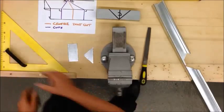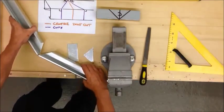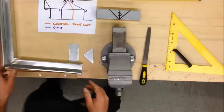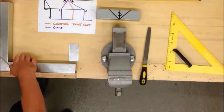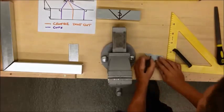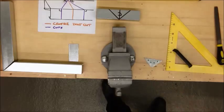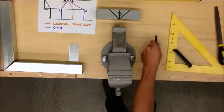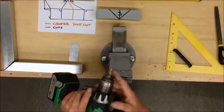Next up, I've got a 90 degree angle set into this bench for these two pieces of timber. You get your trunking, ease it into that 90 degree and make sure that your cuts are accurate - which they are. This piece on the inside of the trunk is going to fit there and be riveted together to join the trunk back together and give it some strength. The first thing I'm going to do is mark a couple of places on both sides for my rivets to go. Then use a center punch. By punching it, that will stop the drill screwing around and help it stay central to where you want to cut. I've got a 4.5mm drill and I'm using 4mm rivets.